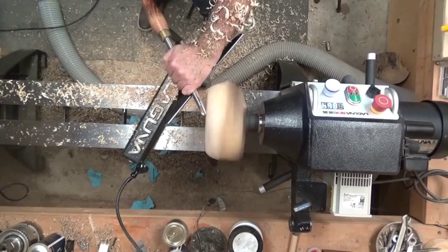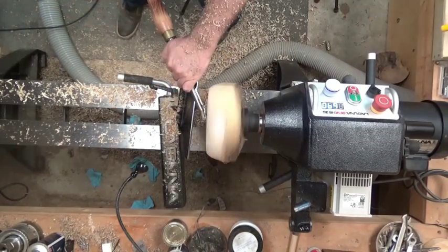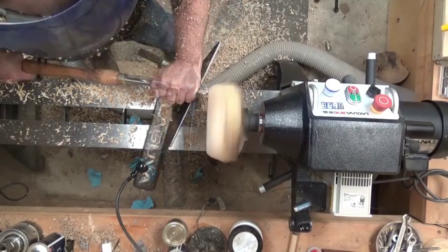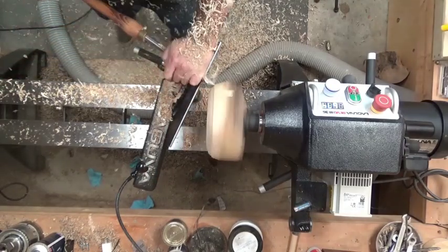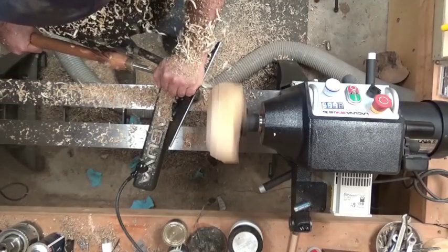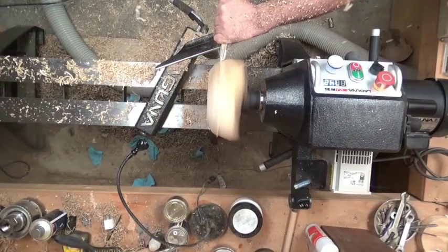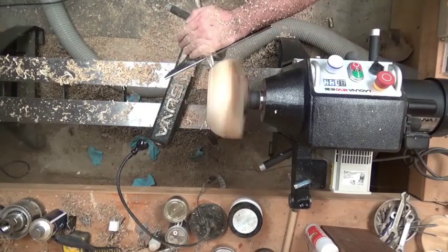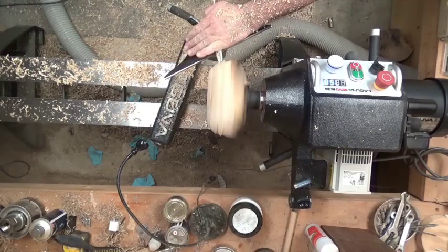It's one that I cut myself from the log. Just a bit of shear scraping and now I'm riding the bevel to make the bottom of the bowl flat — full cuts with shear scraping and push cuts, riding the bevel, trying to get around that corner. When I get to the edge I'm going the opposite direction. I'm trying to maintain the bark on the edge of the bowl, so I don't want to go into the bark.